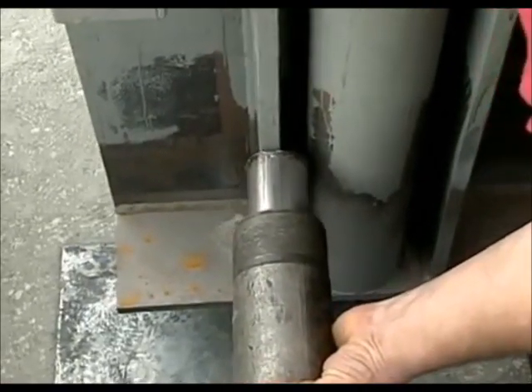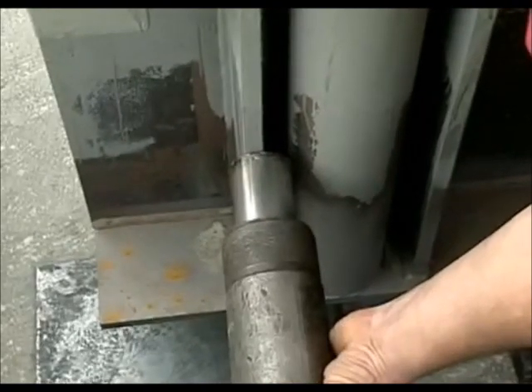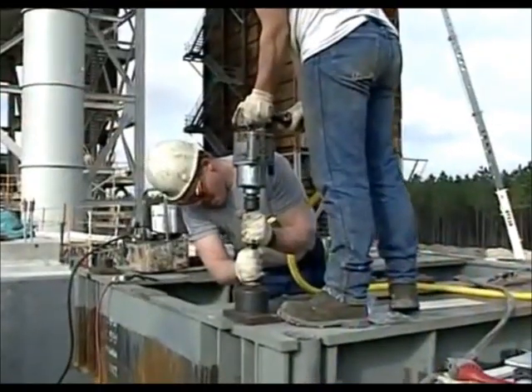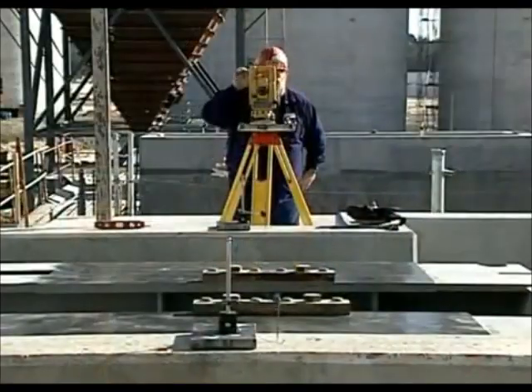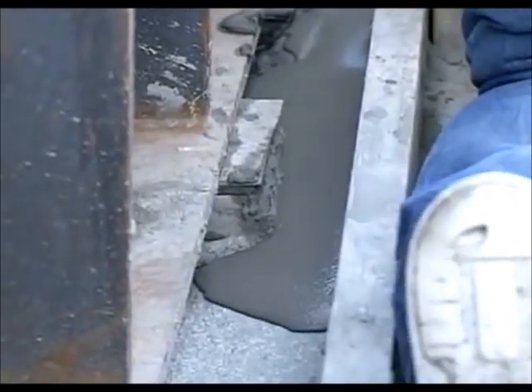The first critical step is the careful positioning and setting of the base frames. Once shot in, tightened down, and positions verified, the grout is poured. It all starts from the grout up.